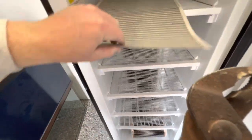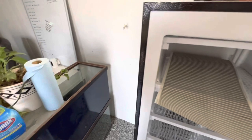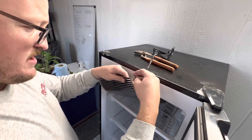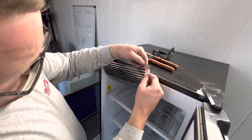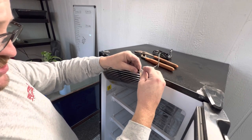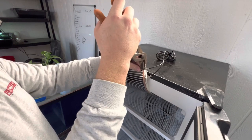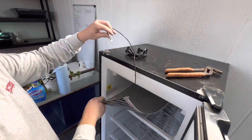I'm gonna pull this through and show you guys how we're going to hook this up. So we grab one side of our connector and get it to go through and clamp on as such. What you're going to do is get it around the copper - because the copper is what conducts the electricity - and then you're gonna crimp it so it pierces the copper. Squeeze it real good, give her a little tug - she's on tight. Now we gotta do the exact same thing to the other side.